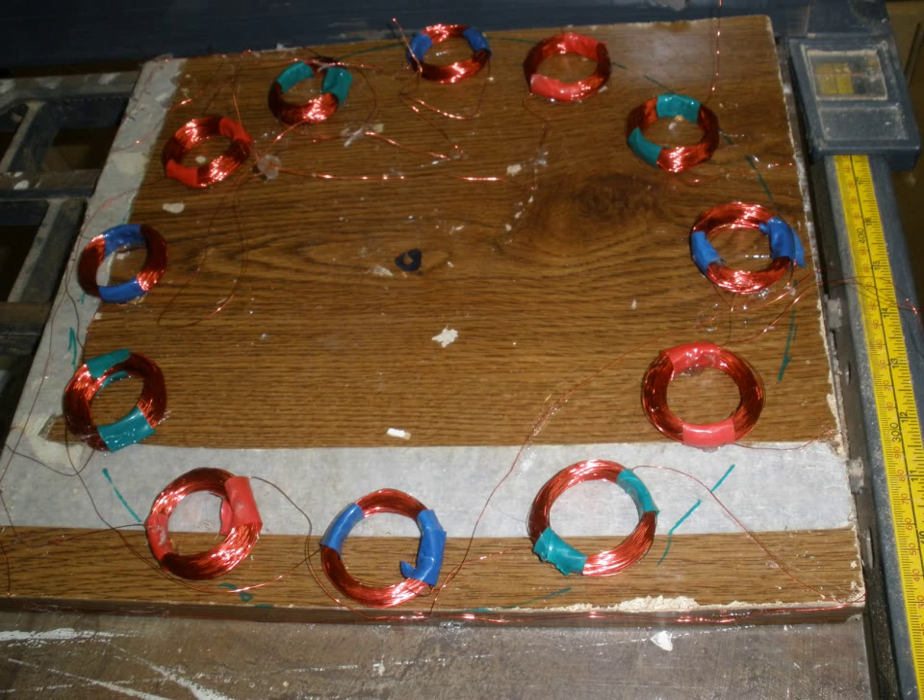Have your 12 inch diameter circle cut. When placing the coils down, you want to alternate colors and also alternate the way they are wound. So you have one set of coils wound clockwise, the next one wound counter-clockwise, all the way around the 12 inch diameter stator.